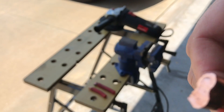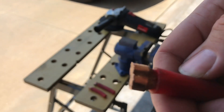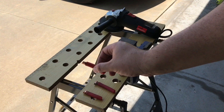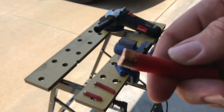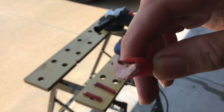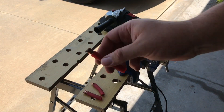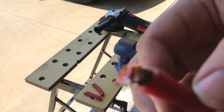Okay, I'm gonna give you a look at them here. The first one is the hammer and screwdriver method. The second one would be the hammer crimp method with the actual tool — you can tell by the V shape that it has. Now the third one is kind of mangled up; that's the hydraulic method and that's the one I didn't really get a clean cut on.